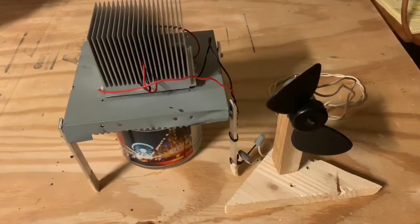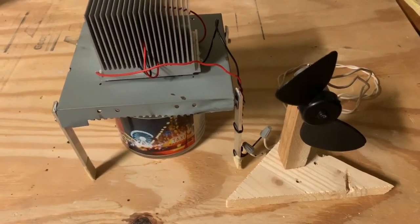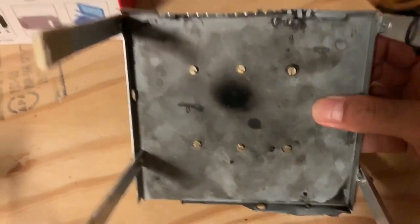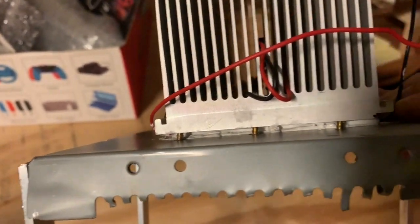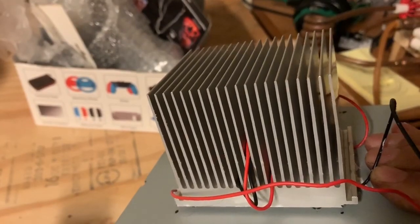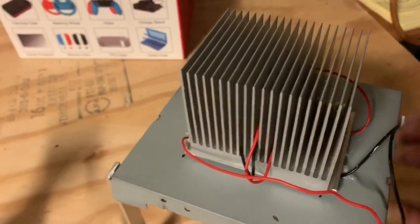Here's it assembled. So this is what everything looks like when it's finally put together. Let me show you how I got the final thing together. I drilled six holes in the bottom so that I could attach the heat sink, as you can see there. The screws just go into the bottom of the heat sink, and that applies pressure to the thermoelectric units — there are two of them under there — which has thermal paste on both sides. So I've got good thermal contact with the heating plate, which is this thing, and the heat sink, which is that.